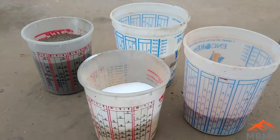Now, my view on production smelting has kind of evolved a little bit. I've done enough experiments now that I understand that you're never going to be able to get all the gold. But if you can get a high percentage of it, 95% plus, in one smelt, even if you lose a little bit to the slag or a little bit to the mat, that's okay, because the little bit of gold that you lost, you can't make up the value of it in time and energy resmelting and smelting 3 or 4 times to get it all.